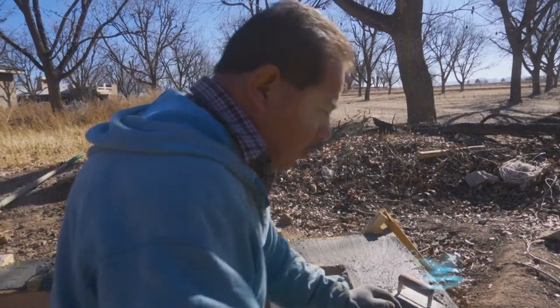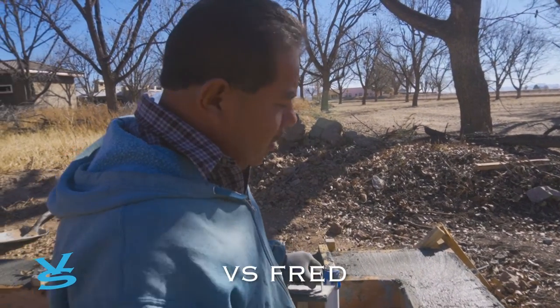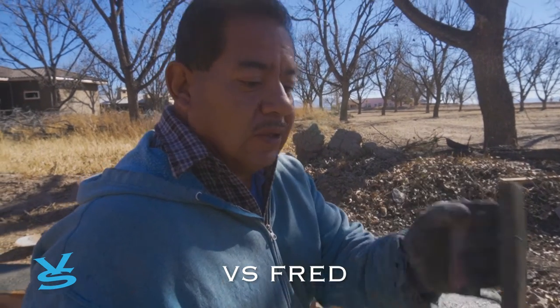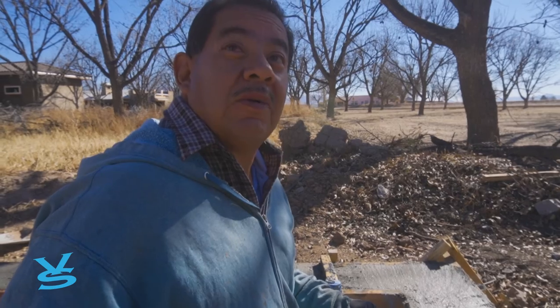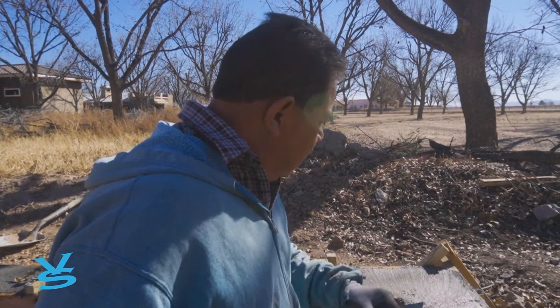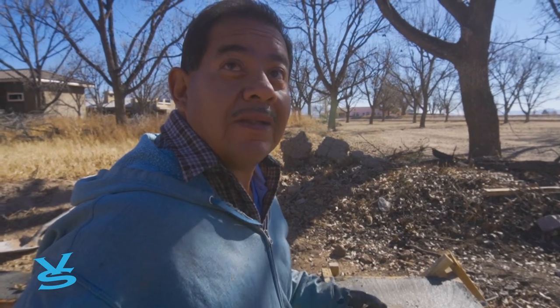We just poured it — the truck lifts the wall and goes. We're doing the finishing: troweling it and then using this tool to do an edge around it on both sides. We've got to do it now while it's still a little bit wet, because if it dries we won't be able to work, so we've got to get it done before it dries completely.